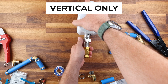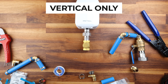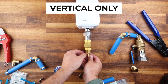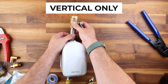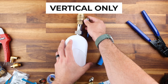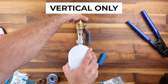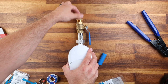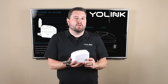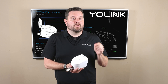If you choose the vertical installation method it's even easier because we only need to install the check valve and the quarter turn valve if you're using a straight piece of pipe going vertically. Note if you do need to make room because of other obstacles you can do the same u-shape that we did on the horizontal method but just flip it for vertical. Then we can use this temporary u to hold up against our water line and measure and mark where you want to install the system. Just follow the diagram in the instruction manual or linked below.